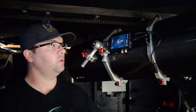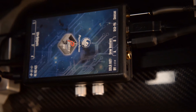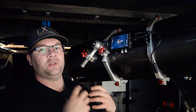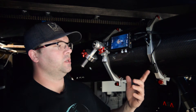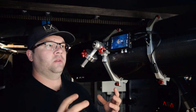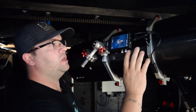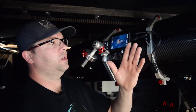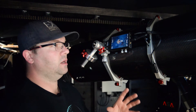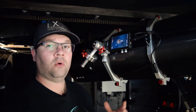This is my dew controller. This particular one is the Pegasus Astro. It's a power box, so it does more than just controlling how much power to apply to my dew heater. It takes readings from this sensor, reading ambient temperature and also humidity, and it calculates the dew point. The dew point is where the air around us starts to form dew. According to that measurement, it applies just a sufficient amount of power to heat up my secondary mirror — or it could be the corrector lens on a Schmidt-Cassegrain, the front lens of a refractor, or even a guide scope or a DSLR lens.